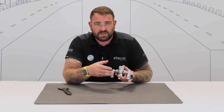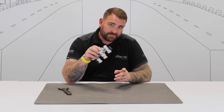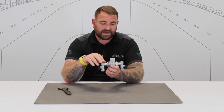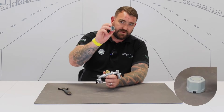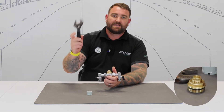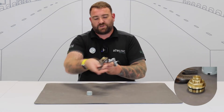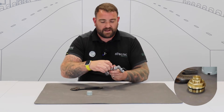Once that's done, we need to start exposing the internal parts of the valve so we can make sure they're working as they should be. That's pretty simple to do — it'll probably still be in situ, you're not going to take it out to do this. What we do first of all is remove the protection cap, which is going to expose the head work of the valve. Simply get a spanner on the large nut on the top, unscrew it all the way, and take that out.